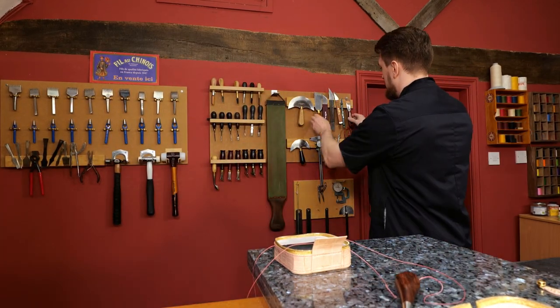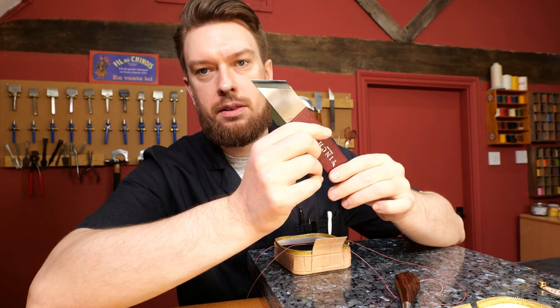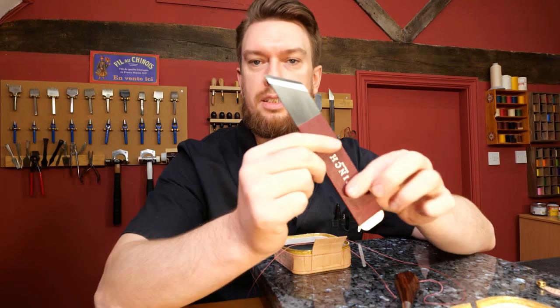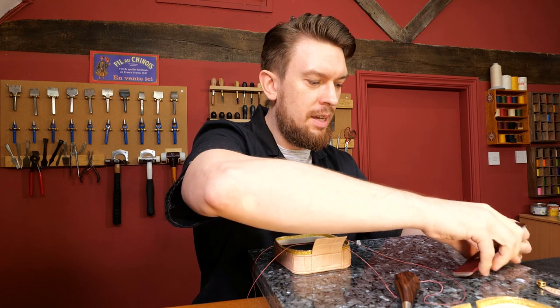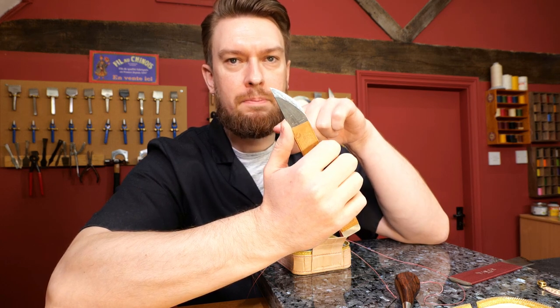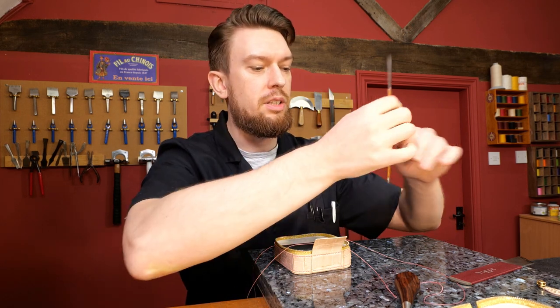I'll show you the paring knives I made. This is the first one - an English paring knife with a slightly shallower angle, less acute. Up here is a George Barnsley. This one is high speed steel wrapped with a little goat skin just for comfort - great blade, very hard, about 62 Rockwell. This is a hybrid English-German paring knife - very typical angle for English, but with a very slight belly to it, which means you can pare leather in the center rather than the edge, and the corners are away from the leather. So you can change the angle and change the depth. It's got a little ostrich skin wrap on there.